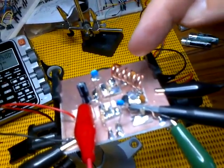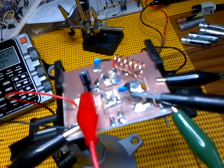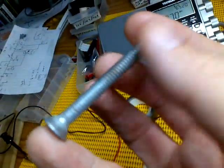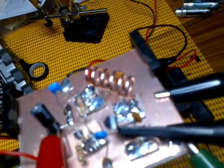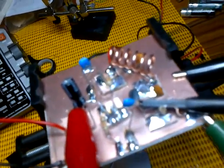You've got a homemade inductor here, which is basically wire that's been wrapped up on a small bolt — I happen to have one here — it's a quarter-inch, 20-thread bolt. Now, the instructions say to use four turns. I ended up using six turns just to try and lower the overall frequency that I was getting out of the circuit.